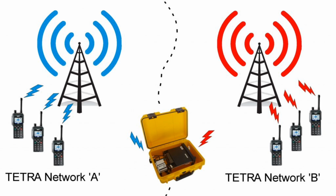Okay, fascinating. So beyond how it's installed and configured, what are the sort of the raw specs? How tough is it performance-wise? The specs really back up the rugged design we've been talking about. The operating temperature range is pretty wide, like minus 40 up to plus 55 degrees Celsius. Storage temps too. And that IP66 rating we mentioned, dust tight, water resistant. Physically, yeah, it's got some size and weight, but it's built to last in potentially harsh spots.